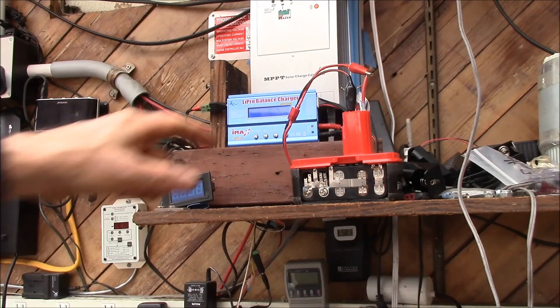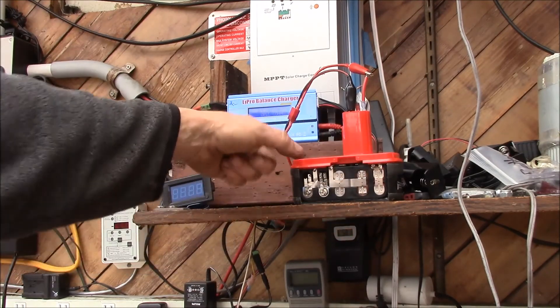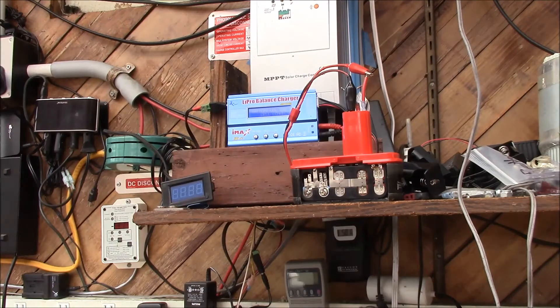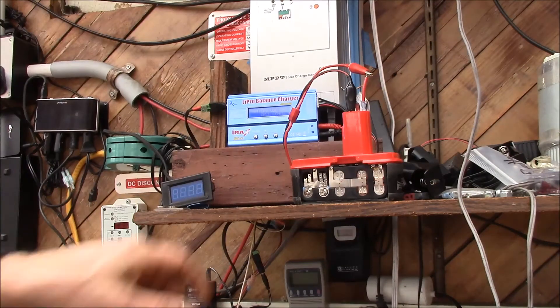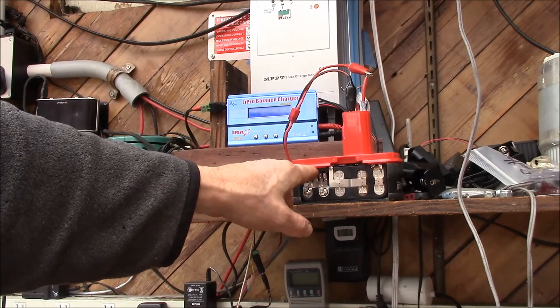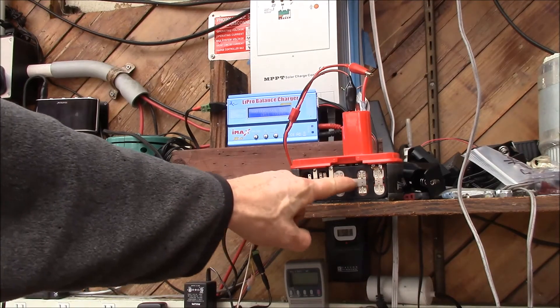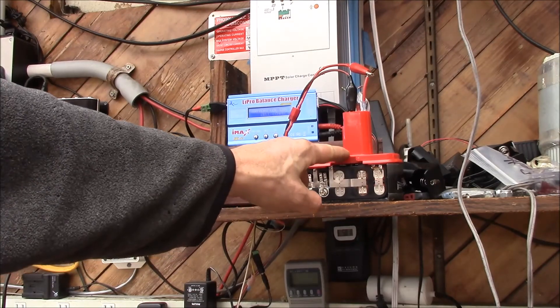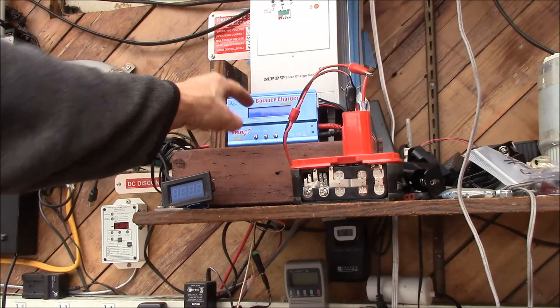This is a battery that doesn't like to be charged through these terminals. I can clip directly onto the negative side and positive side and charge it no problem. But going through the power post, you have to pass through the MOSFET — it's the battery protection IC that controls the charging MOSFET. If that little IC is not happy about something, it shuts off the charging MOSFET, and basically the MOSFET capacitance charges up to 20.5 volts.